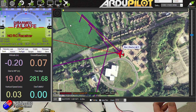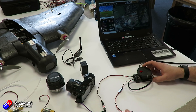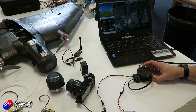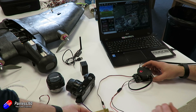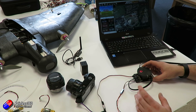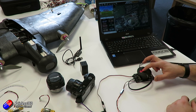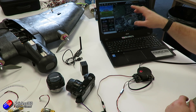In order to test that it's actually triggering, once you have made those changes to the camera trigger, you need to reboot your Pixhawk, which we've already done. To test the camera trigger you also need to have power to the rail for the Seagull MAP2 — in this case we're using a 5-volt BEC connected on the bench. You also have to have the safety switch pressed. We have the solid red light, so the safety switch has been pressed.